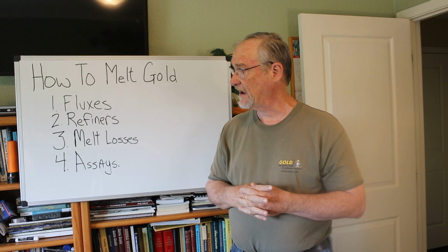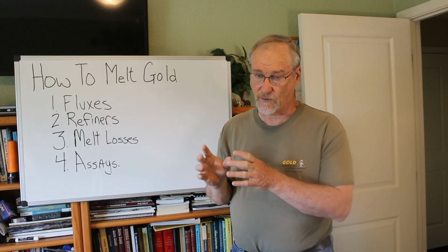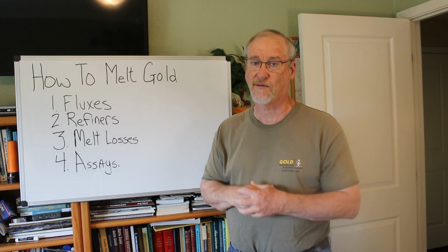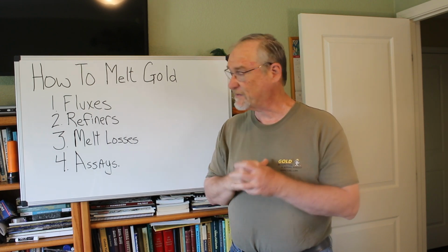I recommend, if you're going to melt gold, that you go with something that's gas fired, propane fired, and that's what I use. All my little one, my bigger one, they're all propane fired, and with propane there's no problem getting to the temperature to melt gold. So that's my first thought.